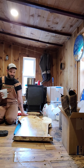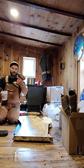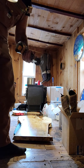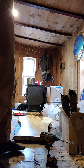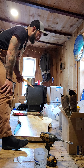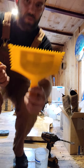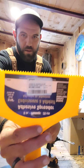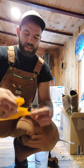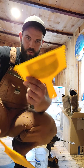Underneath this, just to keep it off the floor, I have a storage crate. I bought a drill with an inch paddle bit - for small projects I've used it and only it to mix epoxy for about the last year. I also have notched spreaders - they have different tooth sizes available. This one is a 3/16th and this one should be the 3/8th. It all depends on the thickness you want - obviously the bigger the tooth, the thicker it's going to lay.